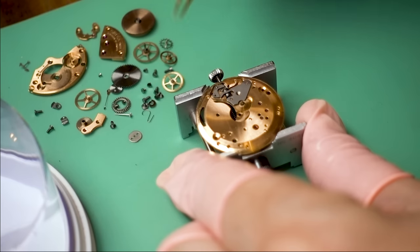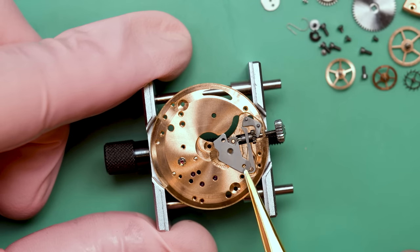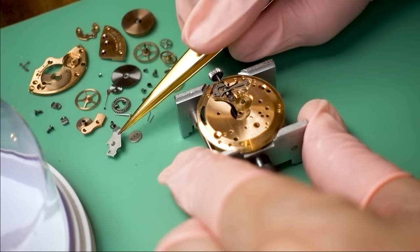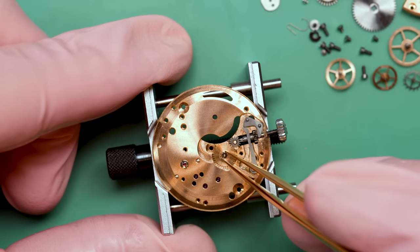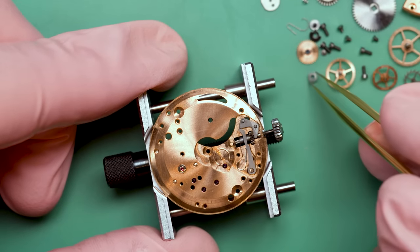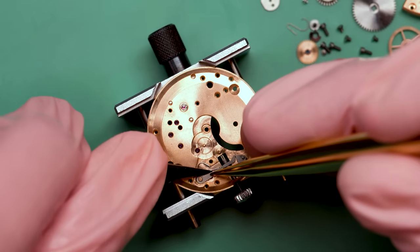You know, sometimes if that breaks off, it'll still be in the case, but it looks to me as if somebody was in this watch and kind of wanted to sell it, and that's why they put it up on that, and then maybe just put this broken setting lever spring. The watch will actually work still without it, at least a little bit, but it won't work well and it won't work for very long.